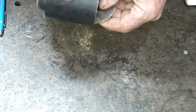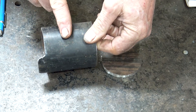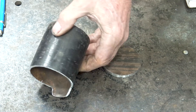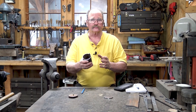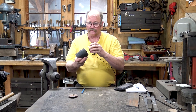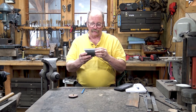The next thing I want to do is go ahead and flatten this out. I'll take that to the forge. I also want to scale this up quite a bit, so I'm going to run the forge at a fairly high heat, wire brush it, put it back in, heat it up, wire brush it. I want to give this some texture but I don't want to hammer on it, so I'm hoping that the scale texture from the forge will do a nice job. A lot of this is really more of an assembly project - sort of a fabrication project - except I'm going to try to avoid any actual arc welding. Although if you really wanted to, you could tack weld the bottom in and it would hold just fine. But I think the rivets are a little bit classier approach - they're going to be part of the decorative element of the whole thing.